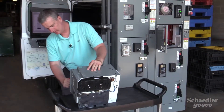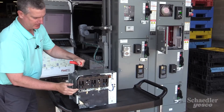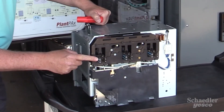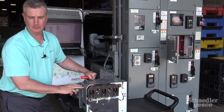I'd like to demonstrate the actual mechanical actuation of the stabs. The stabs are the part here that are actually connected to the vertical bus. Here you can also see where they're electrically connected, to validate the isolation from the power to safely remove the unit.